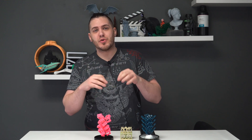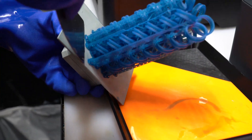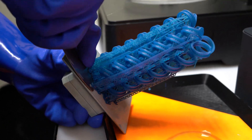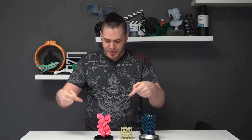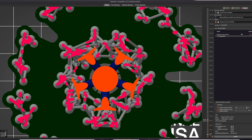We lower the support head size, making them about 0.2 to 0.3 millimeters for the actual head itself, and strategically place them along the bottom edges — only the stuff that actually needs to be supported. During that first video, we talk about how important it is for you to have the sprue — the actual thing attaching it to the center rod — being your lowest point so that you can have it grow naturally into the object and avoid having as many supports as possible.